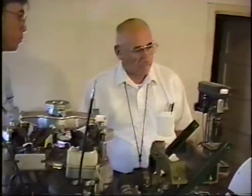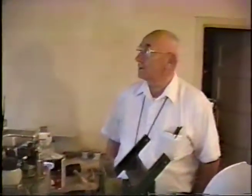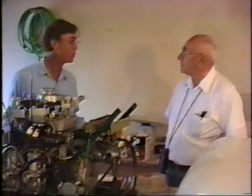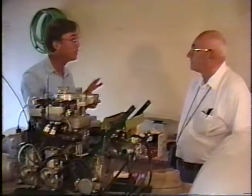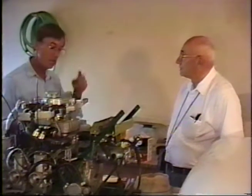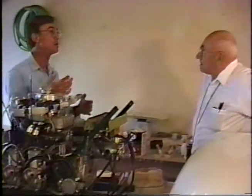I saw a study by B.J. Holmes. I built an airplane a long time ago called the Amsoil Rutan Racer — I built the fuselage right here. I've been involved in some interesting projects. B.J. Holmes came out with some sublimating spray paint — he flew out from NASA with this paint that you put on the surfaces to determine where laminar transition occurs. What we discovered was that everything behind the propeller was laminar — even the wing, even the fuselage was laminar.